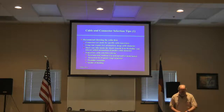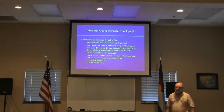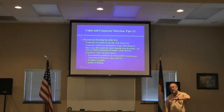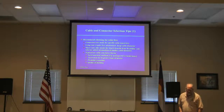As a result, you probably want to keep a stock of cable for building arbitrary length cables. In my case, there's a minimum of two cables I want to keep: a large diameter cable for long runs with low attenuation but may not be so flexible, and a smaller cable like LMR 240 for inside the shack or feed-throughs from the panel into the shack. The typical selection criteria for cables include environmental conditions, attenuation, flexibility, and shielding quality.